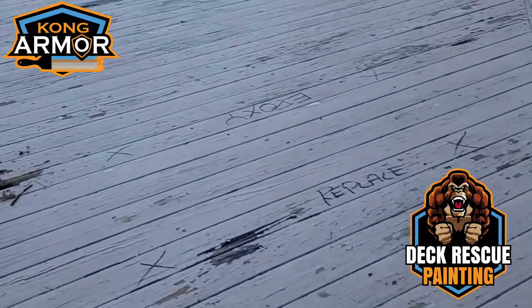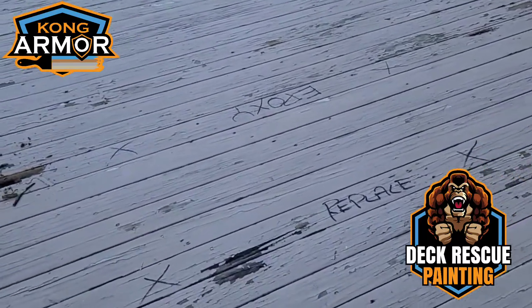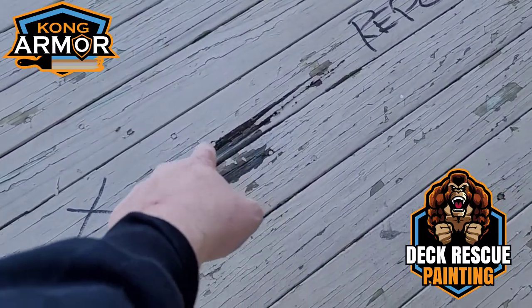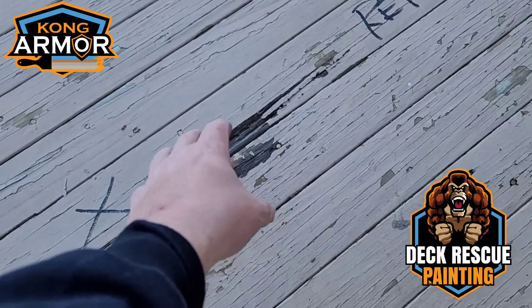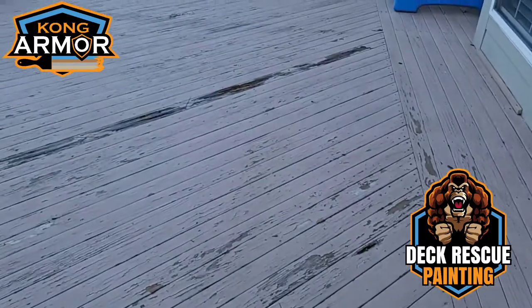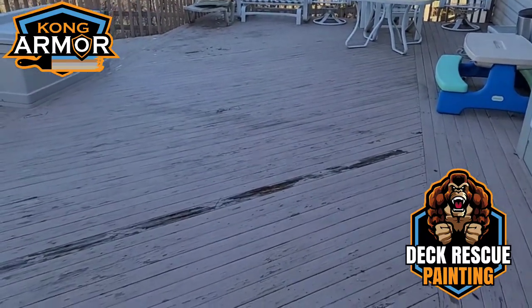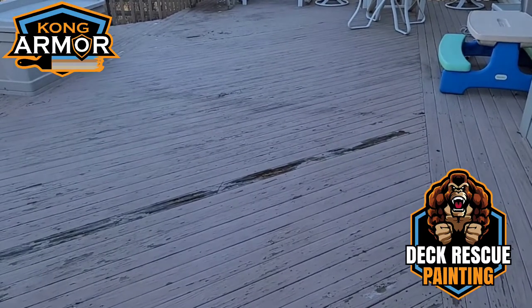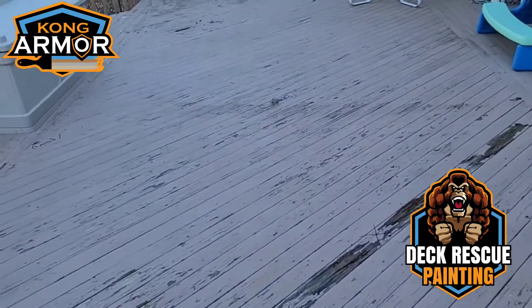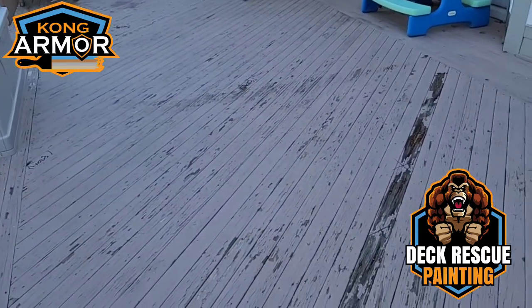Come up here and you can see what I'm talking about. They're starting to have the wood react to the rust of those nails, and it's starting to rot out around there. So they need several boards replaced, they need areas of epoxy repair, and areas where there are minor holes that we can go ahead and stop that process from continuing. Three, four, maybe five boards need to be replaced here.